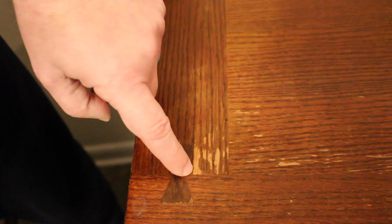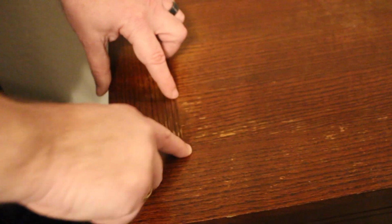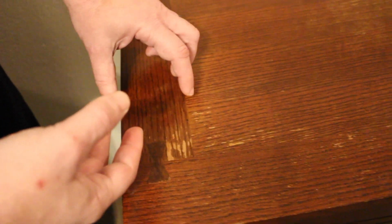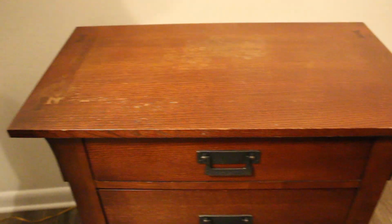Right. Well, what would you call this thing? Well, I want to call it a butterfly. In traditional woodworking it is designed to make this, if that was a real joint, really tight. So it has both a functional and a decorative purpose. And look, it's somewhat similar to the dovetails that we saw on the drawers. It's just a slightly different application. And it shows how good a craftsman you are, because this has to be very precise to look good.